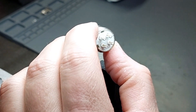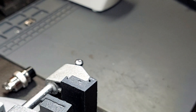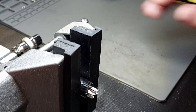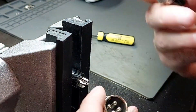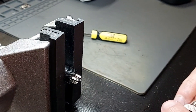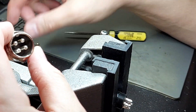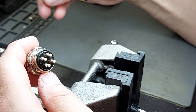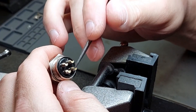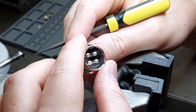The other one is the H17 — and this is a typical over-under soldering pattern. Same idea, same principle. Another question I always get is: do you have the male connector end for the black connector? I do — it's right here. I have some guys that will want to change out their connector, and that's fine to do, depending on whether you have the skill set. You can see the size of this — definitely want to pay attention to that. You can see the cups on this as well: over-under format — one, two, three, four, all the way over. Not the easiest to solder; definitely takes some practice.